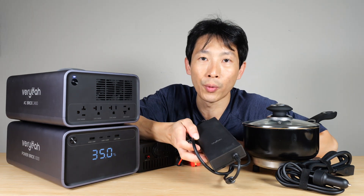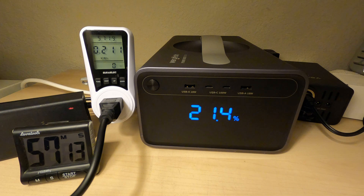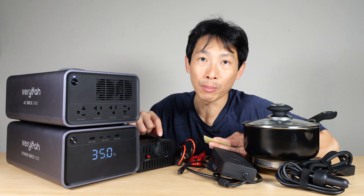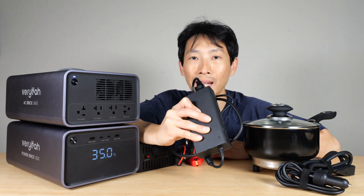The charger here is 240 watts. Let me run some tests to make sure everything is working as advertised. It takes about 4 hours and 52 minutes to charge the DC brick from 0 to 100%. It took 1,097 watt-hours, which is 108.8% of the rated capacity, wasting a relatively small amount of energy in the AC power adapter.